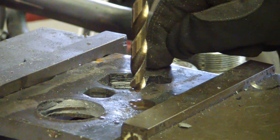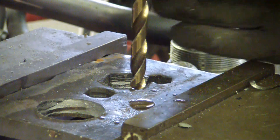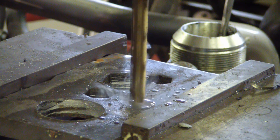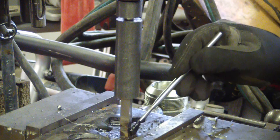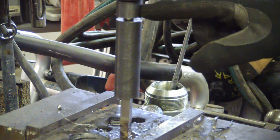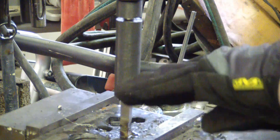You might recognize this sacrificial plate from such hits as Little Screwy, The Death of Little Screwy, Little Screwy Returns, Nightmare on Screwy, Little Screwy versus Jason. Now we've got our 3/8 hole. We're going to put a little Astro Glide on there, and here comes the magic. This is a wobble drive with a ball bearing in there and then the tool bit. We're going to turn this real slow, and it's going to make this wobble, which in turn will make the square tool bit rotary broach this hole.